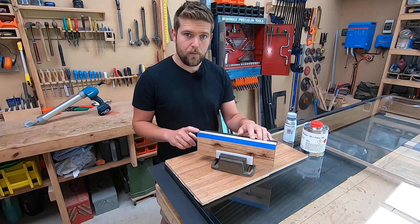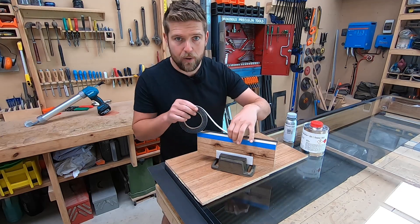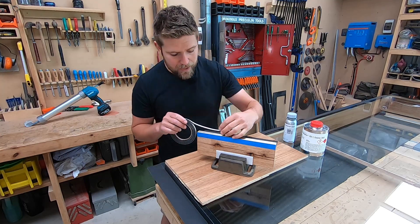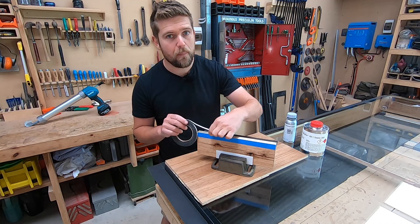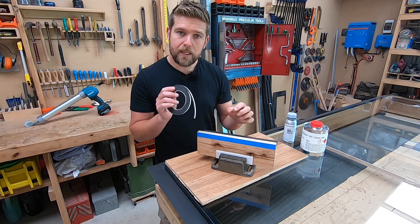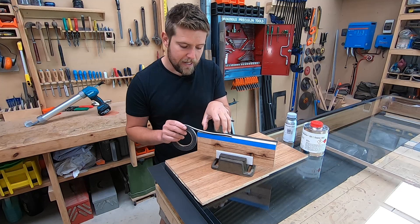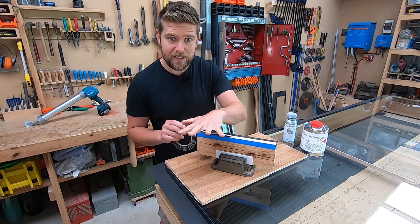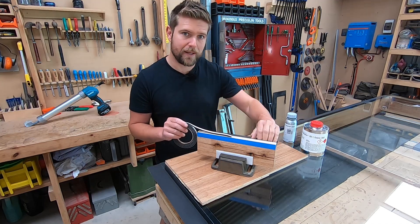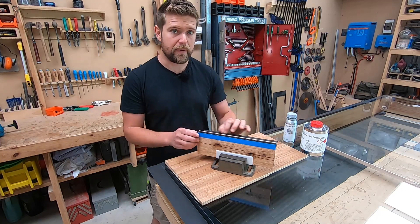Once the primer was flashed off, I applied a glazing tape along the inside edge of my brass, and that provided two benefits. First, it gives me a nice neat compressed foam edge between the brass and my window on the inside, so I don't have a messy adhesive line to deal with. Second, when the adhesive was compressed, instead of pushing inside and going in all kinds of directions, it pushed out to where I was going to tool it off against the outside of the window. So with the glazing tape on, the window frames are now ready to run a bead of adhesive.